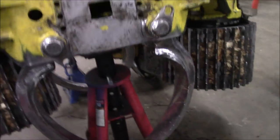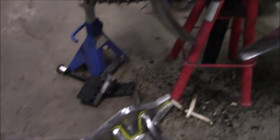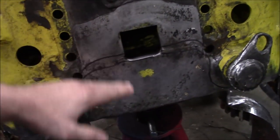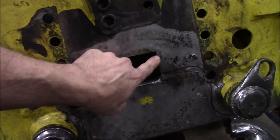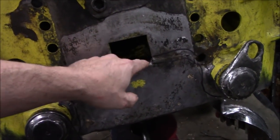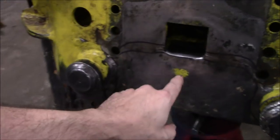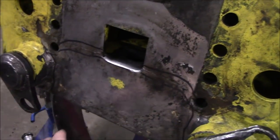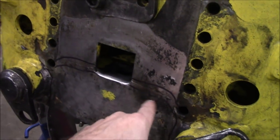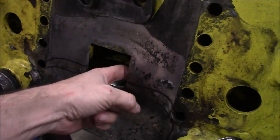You've seen this head before — this is the 270 machine, and there is the top knife with that nice design of the floating top knife. See this big hole in there with no radius corners? That's a hint to you engineers — when you're burning that out, put a radius there, because that's where the crack started. I think we just prove ourselves out every time as smart-ass welders, but right there — from all that pounding of the limbs coming across this thing. You guys that can't see it, pull your knife off and look. I'll bet you you're gonna find it busted up.